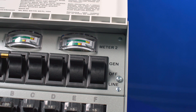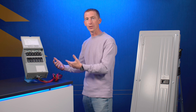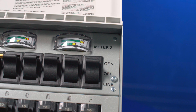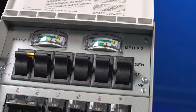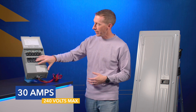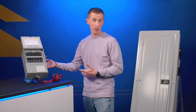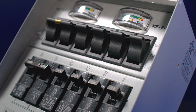One of the nicest features is that once it's installed, you have individual circuit-level control over the devices connected to it. Whatever appliances you have, you can turn on one, two, three, four, ten circuits. There are color-coded watt meters so you can gauge how much power you're drawing from your backup power system so you don't overload it. 30 amps at 240 volts is the max circuit size you can connect, and the largest model we make is 10 circuits. From an installation and operation perspective, this is one of the best products on the market.